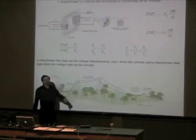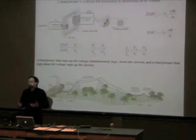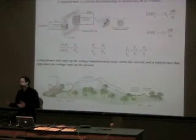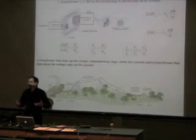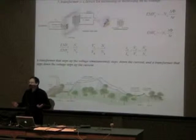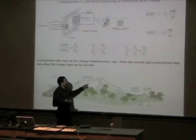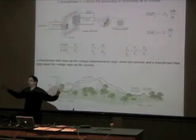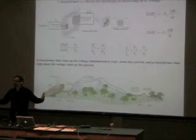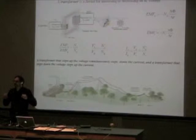You know that the power dissipated by current is proportional to current squared, I squared times R. So the higher the current is, the more power gets dissipated in wires, and the hotter they become. So imagine if you had to transport electricity along a long line. The longer the line is, the higher the resistance. So we would lose a lot of energy.